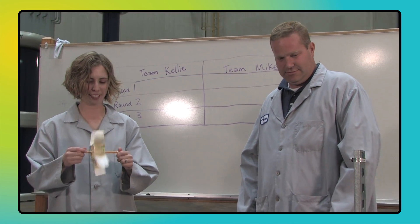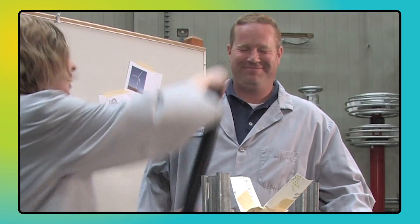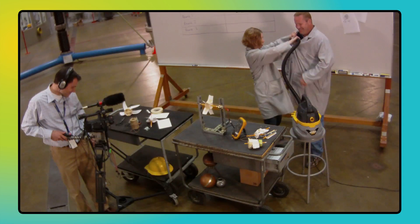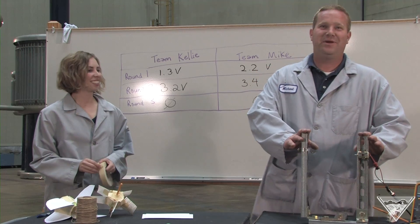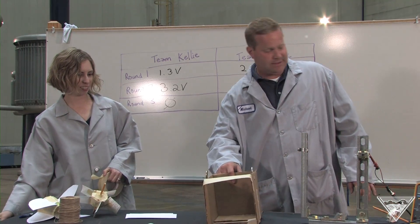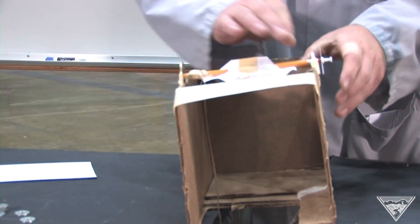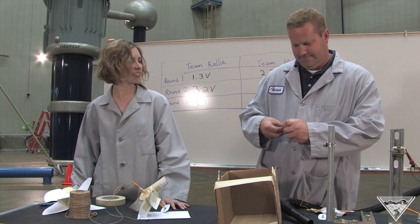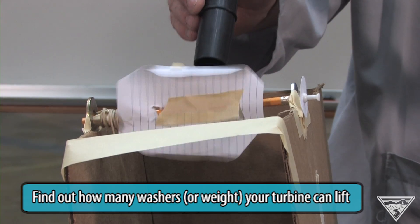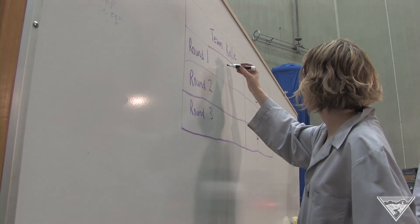Should we test some of them out? We use this kind of test setup today, but if you don't have access to this type of equipment, you can make your own out of a cardboard box and some tape. But instead of using a motor as a generator to create electricity, we can just try lifting a washer. So just like before, we're going to use the shop vac to power it. That's another way to find out how powerful your turbine is — adding more washers. That's one way you can keep score.